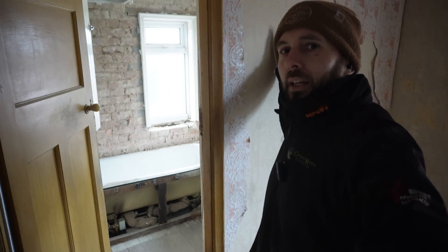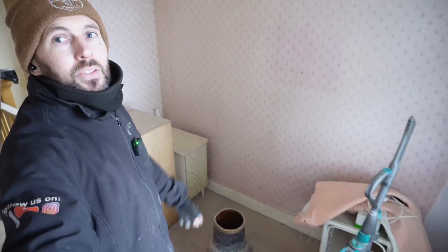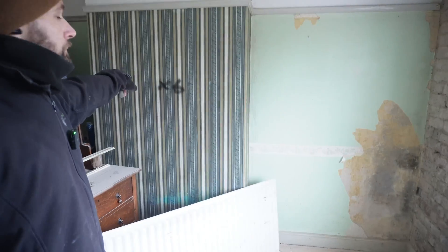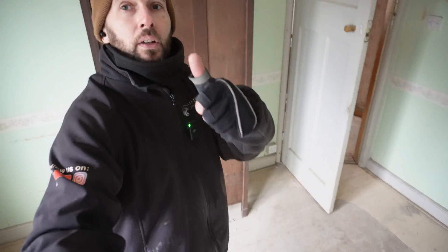The loft hatch is massive so it's now leant to the side - they're going to put a wall light on this one. Bathroom in here is all going to be renovated, so it's just a light going in there for now. Behind me is going to be the office - desks and things going on there. Cat six is going to be run through most of it for where there's TVs. Like most people now, they stream everything. In here is bedroom - socket either side of the bed. And the TV is going on the wall there - no carpets, no nothing, winner.